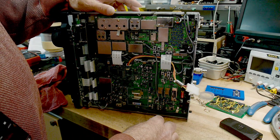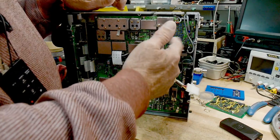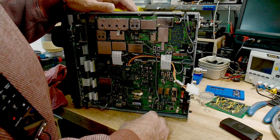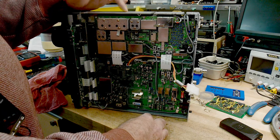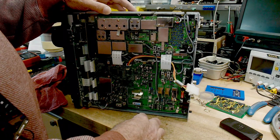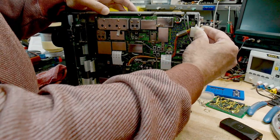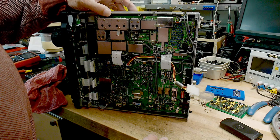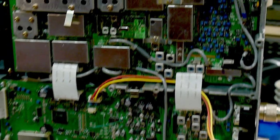People say they go bad all the time. Some people have modified the circuit so the VCC is on the transmit VCC, so it's only powered up when you're in transmit mode. But I don't think I want to go that far — it probably lasted a decade or two before I got it, and I'll replace it and it'll last another decade or two. If I put a little heat sink on it, it might last forever.